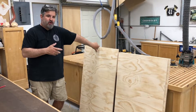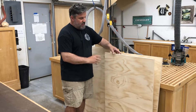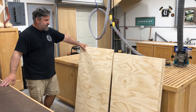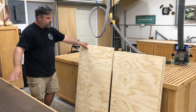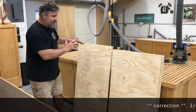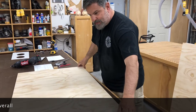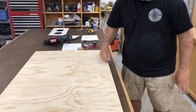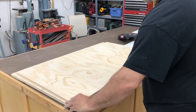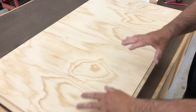I have all my plywood parts cut up. What I have here are the two bottom pieces: the very bottom of the table and what we'll call the bottom filter sheet, which will have holes cut in it. And this is the very top sheet of the table. These pieces are an inch and a half smaller in both directions than the top. So I'm going to put my good side up on the top piece and lay the bottom filter sheet on it to lay all the holes out at once, so I don't have to lay out each sheet individually.